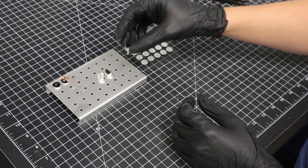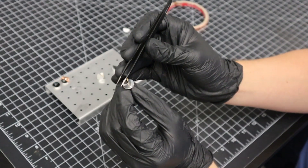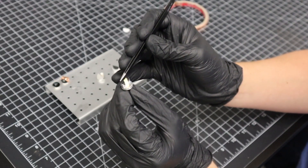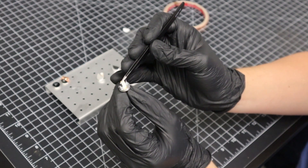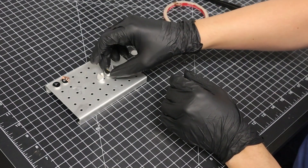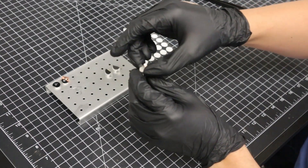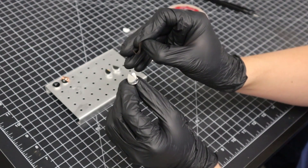If your samples are flimsy, like thin films or fabrics, you want to make sure that the top of your sample is not freely hanging over the top edge, as inside of the instrument it will freely flow in the breeze, so to speak. If your sample is not properly holding onto the surface, like this larger sample here, we can use copper tape to tie it down just like we did before.